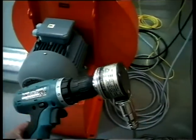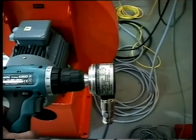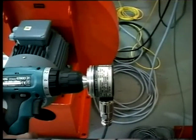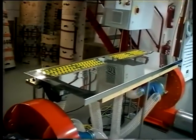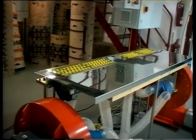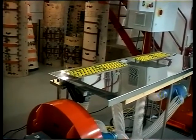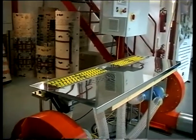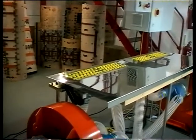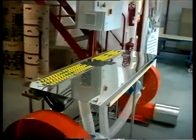The encoder will mount onto your machine at some appropriate place where we need to register accurately to. The shiny vacuum apron which you see here is tailored and bespoke to each installation. It allows the air to spread over a large area, much like water poured onto the table. We don't rely upon rollers to suck it down — that's too fierce and too strong. We use the vacuum apron.